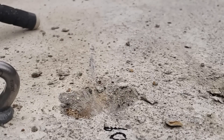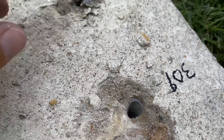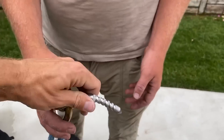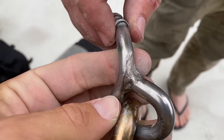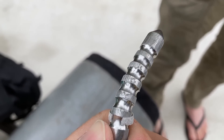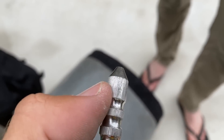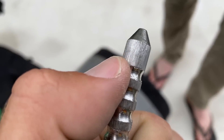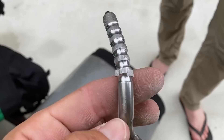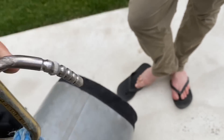Look at all this coning — that's crazy. And you can see the glue is still pretty solid; I can move it a little. This is fragile. Did it pull it all the way out? Yeah. Weld didn't break. These welds have actually been really good in all of our tests. This is the type of shaft it is — some of the shafts we've done have threads on them. These notches obviously are holding well. It scratched up this material a lot inside the notch. It did not twist it out of the hole — I thought it was going to crack it out of the glue and just slip right out, and it didn't.